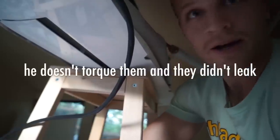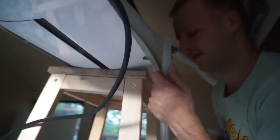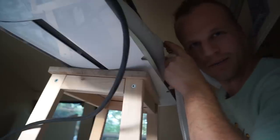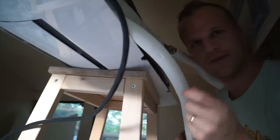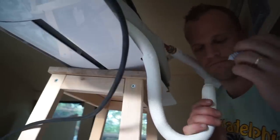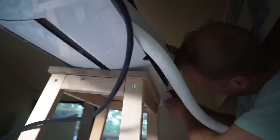Now I've got the drain tube. I think this dinky thing is the drain tube — seems so pathetic. This thing has two drain tubes: one comes straight out the back, and the other one is right here. If you don't want to use one, you plug it. That doesn't fit in there. I have to get this drain hose off somehow — there's just no space. All right, I got it off. I just pulled down on it with a screwdriver and pulled really hard.